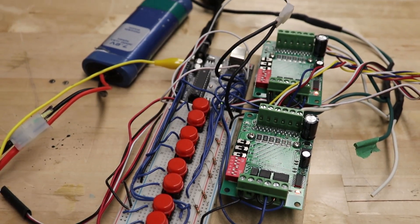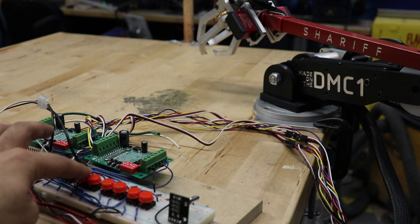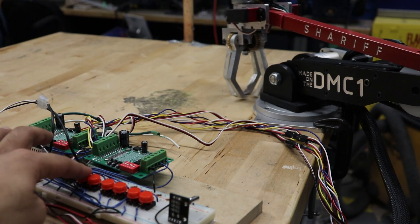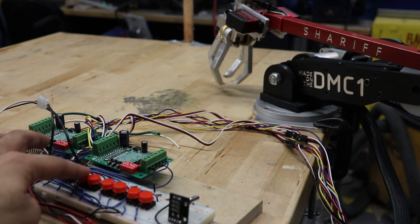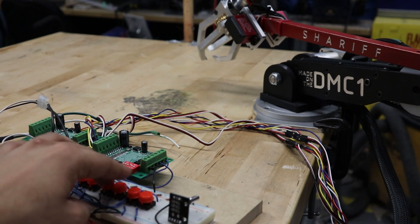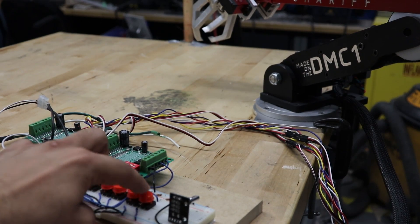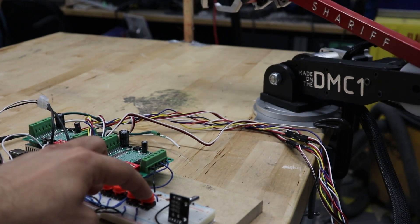For testing this arm, I have an Arduino controlling two stepper drivers and a motor controller to move the arm joints and gripper. For now, I have two buttons to control the direction of each motor when they are pressed, with a pretty crude Arduino code. There's no acceleration for the steppers, which is not optimal for performance, but I really just want to test the mechanical movement to prove that I have a capable CNC, rather than optimize the code for a smoother arm.